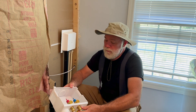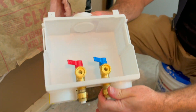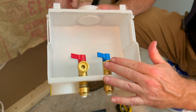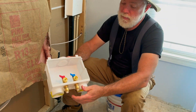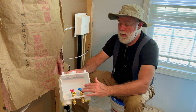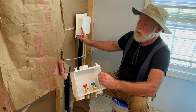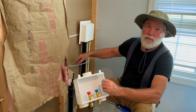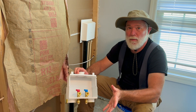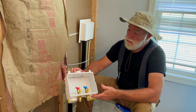I do like this SharkBite box — there are a couple of nice features. First of all, these valves are extremely well-secured inside of the box. They're brass, and they'll also fit onto any type of piping that you want to stick into them. The box is also designed to be glued off to the top of the drain, which means that if you do get any kind of a leak, it all goes into the drain and down — whereas the old box has the drain sticking up inside, which means leaks just run out the front. I want to try to use this box, but I have not been able to source a 2x3 SharkBite box that would fit inside of this wall.